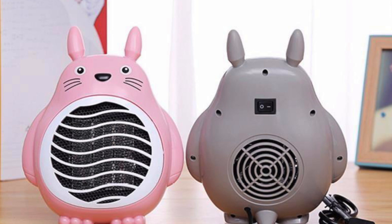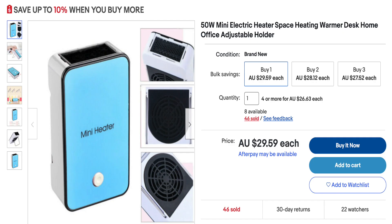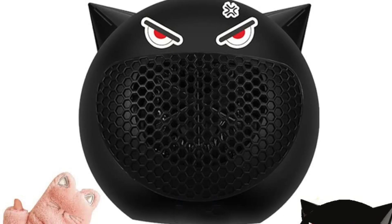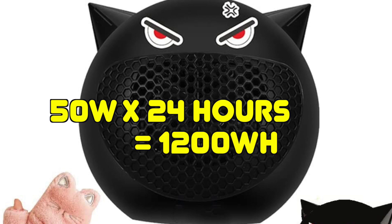Fourthly, you can purchase a small 40 to 50 watt heater — I've actually just done that and it's coming in a few weeks. If you're worried about your energy bill, standard domestic heaters use about 2,000 to 2,500 watts, so you'll consume far less power. You'd have to run the little heater for 24 hours before it uses around 1,000 watts, which would be maybe 40 to 50 cents.